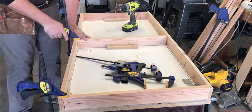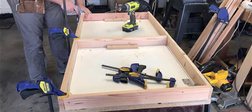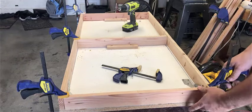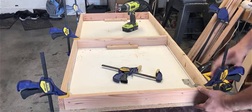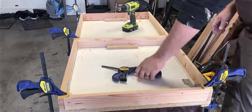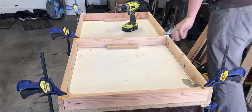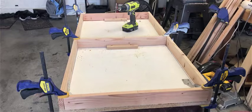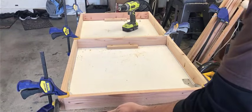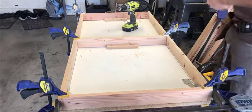That's really important if you want your boards to attach. That'll be one of the final steps, is to put these blocks in there so that your boards can squeeze together using friction. There's no latches or anything necessary, but it's important that all your frames are exactly square and exactly the same so that that method works. If your frames aren't square, they're not going to sit straight either. So I get all those pieces all clamped up. I use a 2-foot heavy-duty clamp to squeeze them in and hold it tight.